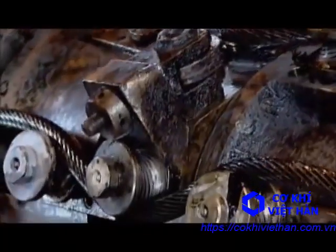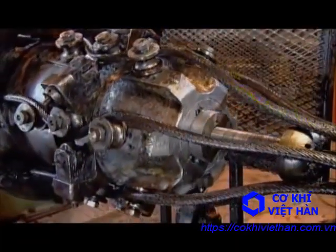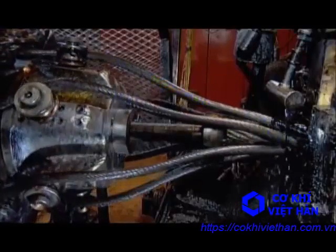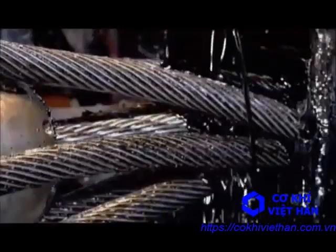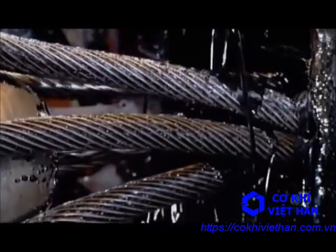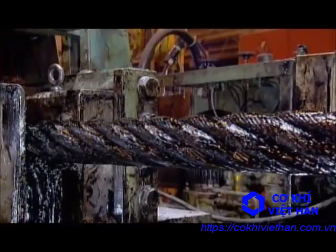They make this particular rope from 6 wire strands. Before the strands converge in the die, rollers pre-shape them into a corkscrew-like form. The strands then enter the die, twisting together over a core, which is itself a small steel wire rope. A core at the center of the cable provides additional strength. This cable's finished diameter is 90 millimeters. However, there are always small variations here and there.